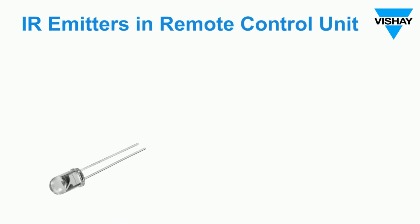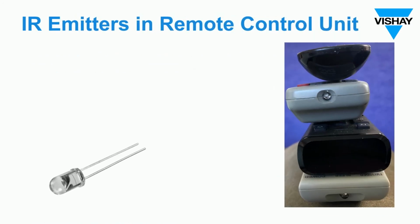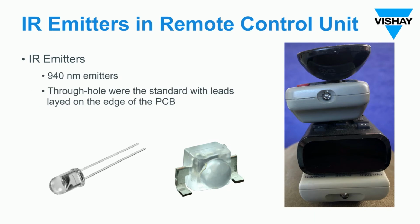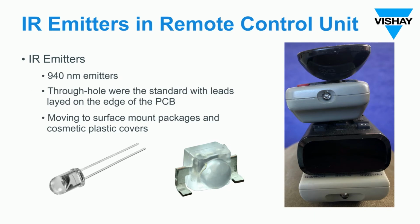So where there is an IR receiver, we need a remote control unit to send a signal to that IR receiver. They have an infrared emitter, which peaks at 940 nanometers, and it'll be either through hole or surface mount devices. And depending on the quality of the remote control unit, you might be able to see the infrared emitter. For example, the second and fourth devices here in the picture, you can actually see this 5mm 940 nanometer emitter, and they've put it in the outside of the package.